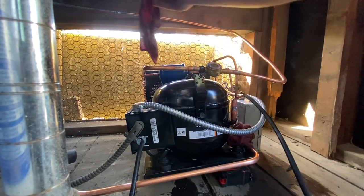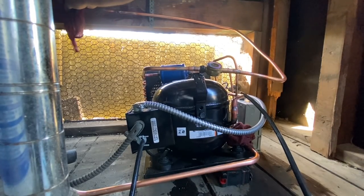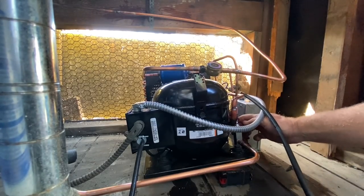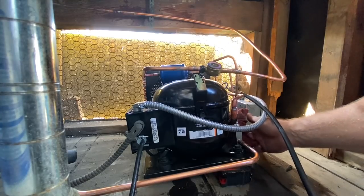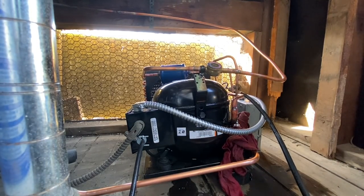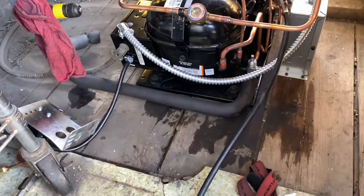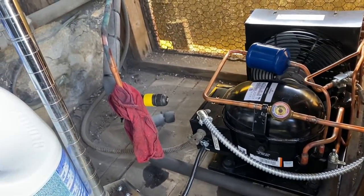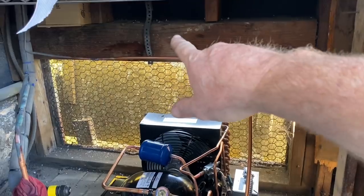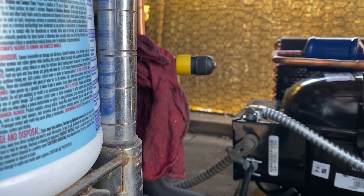I'll get this cooled down. That valve's all steel — it took all the heat. Right to the steel fortress. I'm going to turn my brazing off for a minute, my purge, so I can take this joint apart and slip my insulation back. I got my insulation slid on. I checked that weld with the mirror real good. Let me turn this back on and we'll make that last weld. I'll get some foam tape on that liquid line, get that strap on there, and then we can run a nitrogen pressure test. I've got to hook up the low pressure control, then we'll run a nitrogen pressure test.